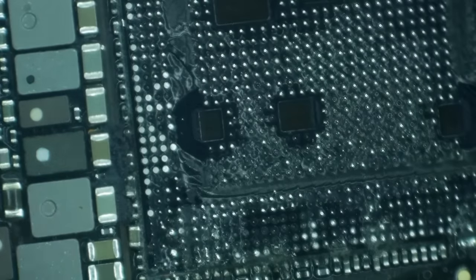Okay, I'm going to raise my air up some. I think the temperature of this room is a little cooler today. I'm going to go up to 370 degrees C. Come on, baby. Any minute, that CPU is going to start to lift up for us. There we go. Keep the heat on, flip it over.